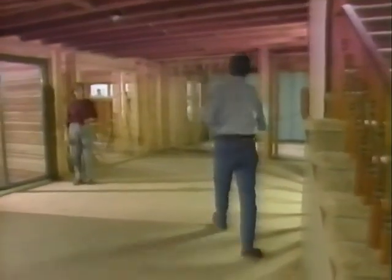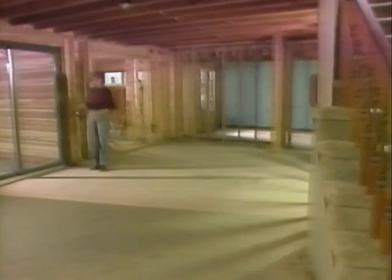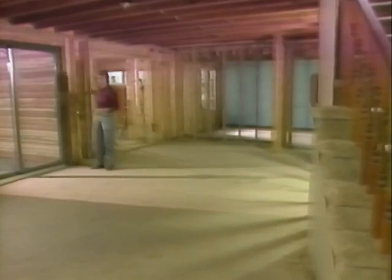I'm changing the single pole switch to a 3-way switch for the stairway light and adding a second three-way switch for the light here in the family room. The second switch will be located here at the entrance to the addition, with another three-way for the addition's switched receptacle. Now, the code and common sense tell you to locate the switches near the entrance to each room. By doing this, you'll always be able to enter and exit a room without fumbling around in the dark.